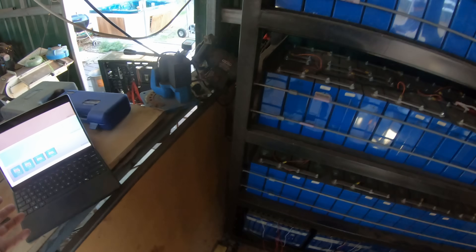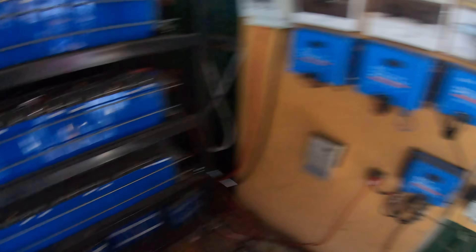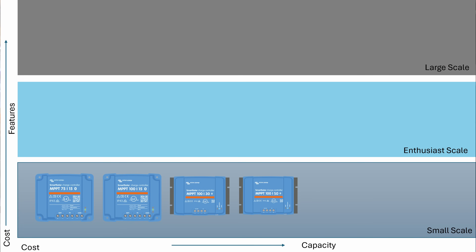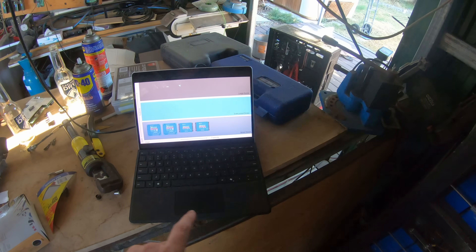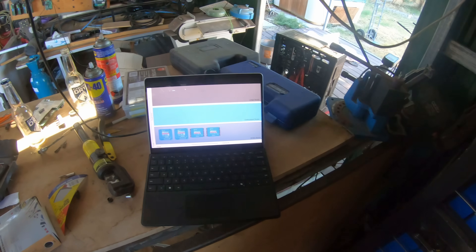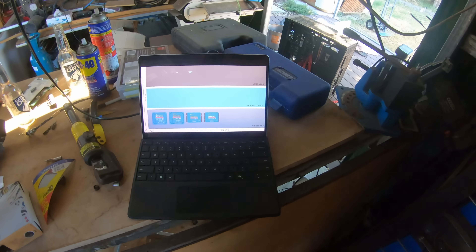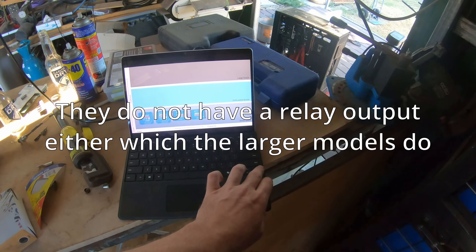In the small scale I've got the 75/15, the 100/15, the 100/30 and the 100/50. They're all 24-volt or 12-volt only systems. Also in the 75/15 and the 100/15, you get a load output, but you don't get that on the 100/30 and the 100/50. When you look up the data sheets, the 100/30 and the 100/50 are actually on their own separate data sheet — they almost should fit into the enthusiast scale, but the enthusiast scale has got more capacity.